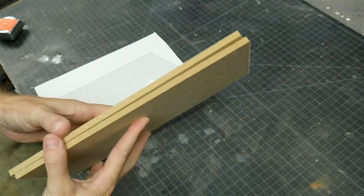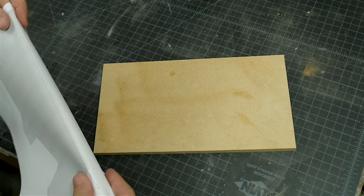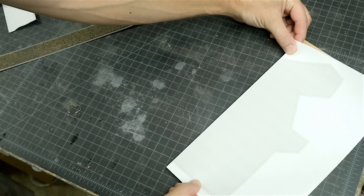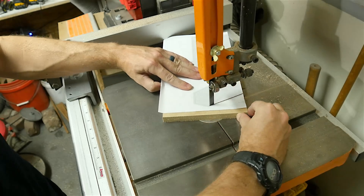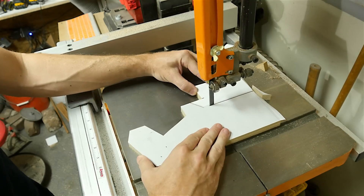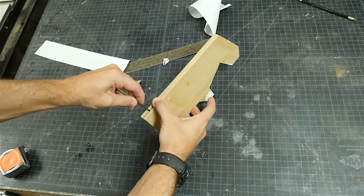Okay, that's all the electronics. Let's put it in a really cool container. I scaled down and printed out the template for my full-size arcade machine, and then used some spray adhesive to attach two pieces of MDF and the template to one of them. I trimmed off the outside edge to line it up with the edge of the wood, and then used the band saw to cut out all the other shapes. As long as you don't use too much of the adhesive, you can peel the template right off and separate the pieces very easily.